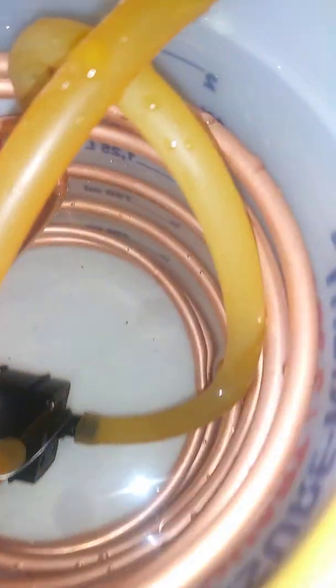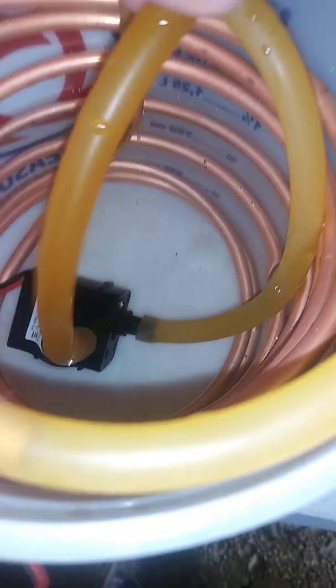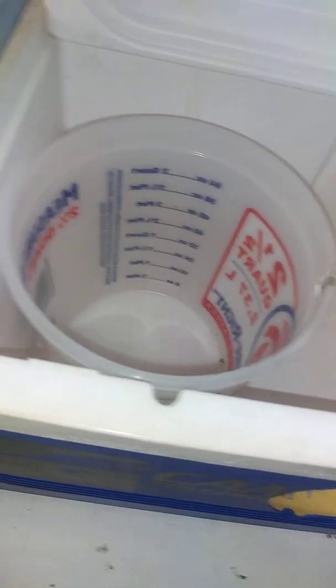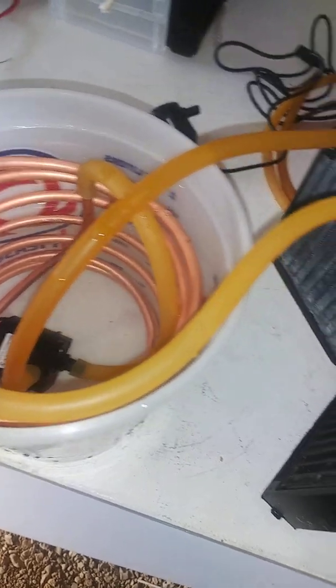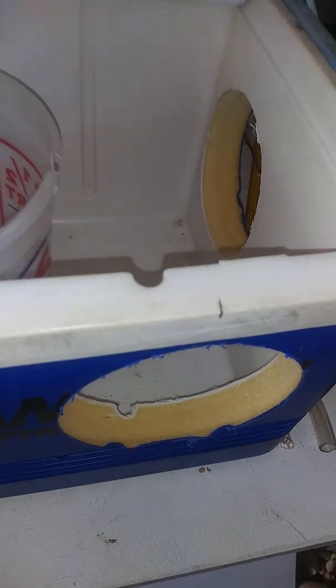You can kind of hear it running — you can tell it's running when it hums a little louder. You can actually unplug this barrel plug and drop this into the ice bucket full of ice, and then it's closed loop. Give it a minute for the ice to chill the copper tubing, which therefore chills the water going through, and then you just have whatever orientation you want on your radiator holes.